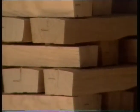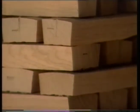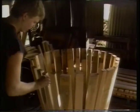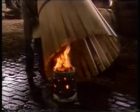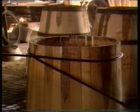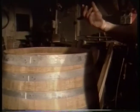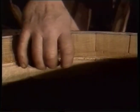Oak is the favourite wood for making barrels — not only do its flavours complement the fruit flavours of grapes in a way that other woods don't, but it's light and non-porous. Barrels present an interesting engineering challenge: how to hold wine in a wooden container with 54 separate seams. Each stave edge has a special angle; the staves are forced together slowly under heat and pressure until a ring can be fitted to hold them tight. Any mistake there means a problem with the barrel.